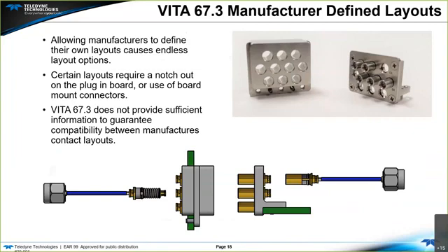Allowing the manufacturer to define the contact layout gives essentially an infinite range of possibilities — and an infinite potential for designers to fall into traps. Designers have to be very careful because different manufacturers' parts are not automatically interchangeable. Also, there are layouts where the lower contact will actually interfere with the board unless the board is notched. These are things that are not necessarily obvious to the designer initially, and we want people to be aware of this so they don't run into problems.